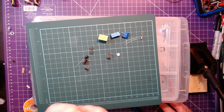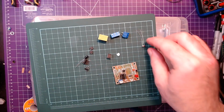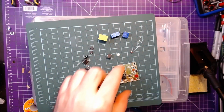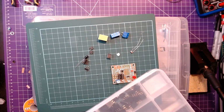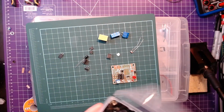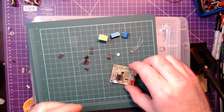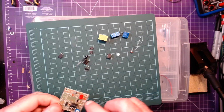We pay a lot. Alright, so we got jumpers. So we can put our cadmium sulfide cell, but I have other cadmium sulfide cells, so I think I'd like to put a jumper on it instead, so I can swap out the cells as necessary. So I've got these double female DuPont. Let's see, cadmium sulfide cell over here.